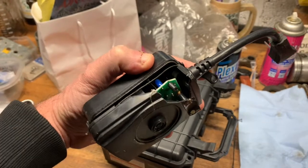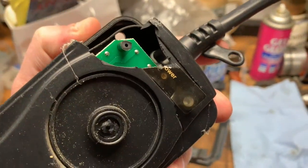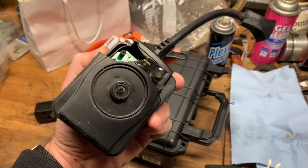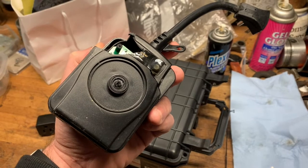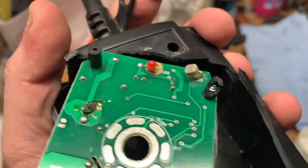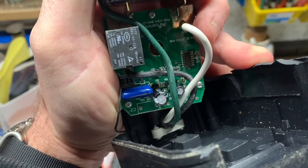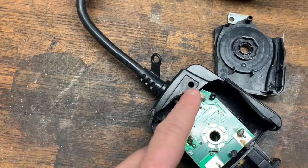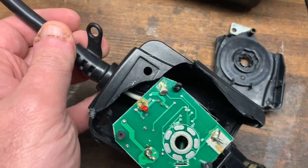Since smashing this on the floor, you can't smell it through the camera, but this smells completely burnt — burnt transistors — which is never good for something supposed to control 120 volts AC safely. The CDS cell, which is the light sensor, is corroded; moisture got to the inside of this module. All they had to do was put it behind better-sealed plastic and it would last forever. Instead, it's crap, so I'm making my own.